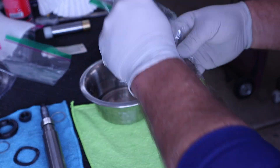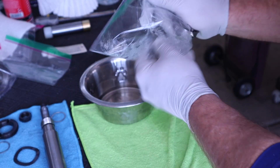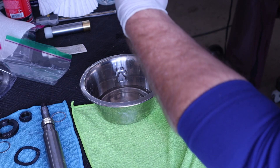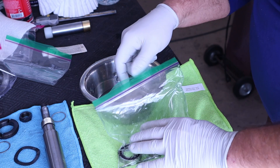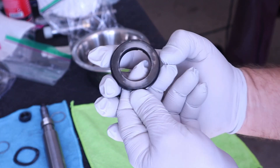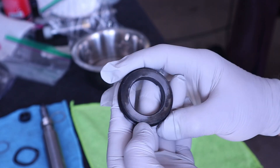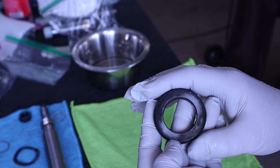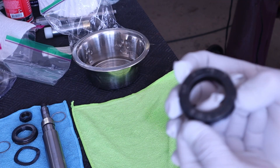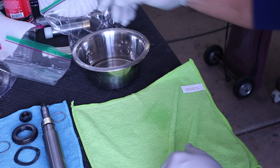Robin does a really beautiful way of setting up for lubricating his bearings — I don't have that ability right now. I'm looking for any kind of particles hanging out in the bottom here — not seeing any. So these are non-microscopically as clean as I can make them. Next I'll have my acetone in this container. These parts all go on the outside. Now I have precision ground flat stones on these. High spot here, high spot there, they touched. I'm not going to change this — I can put it on the grinder, surface grind it, re-deck it, but I don't want to change it from what it was before because I don't know how far it was out. The intent is to leave it as it is and go from that point. The main reason is because I'm going back into the same bearings.